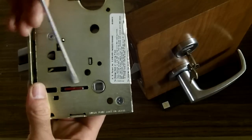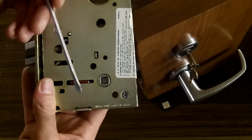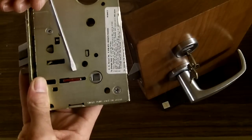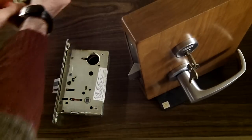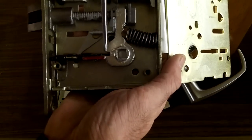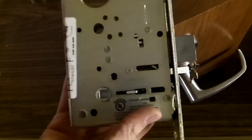First, if you look right here, this red slide right here indicates that this would be the lock side or the outside of the door. And that's one thing you have to do — you have to swap that around. The other thing you have to do is you need to change this. What's going on with this piece, why you have to switch that, is because on the inside, that piece interacts with this piece. And by sliding it over, it locks that hub. Now, if you look on the other side of it, you'll notice that it's half the length.